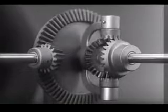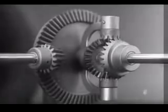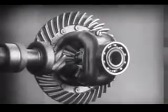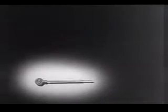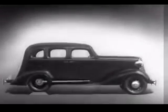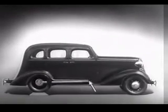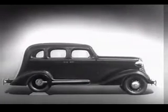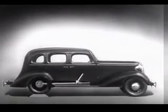Notice that the power is connected to the differential at the center line. We can make our model more compact by moving the gears closer together. When we put our differential in an automobile, we have to leave room for the drive shaft, which carries the power from the engine. We may build the floor of the car above the drive shaft. But if we do, we won't have much room inside unless we make the top of the car high too. Of course, we could lower the floor and ceiling, but the drive shaft would be higher than the floor.